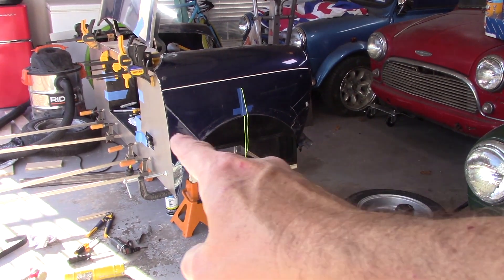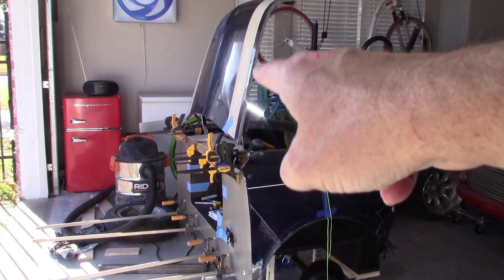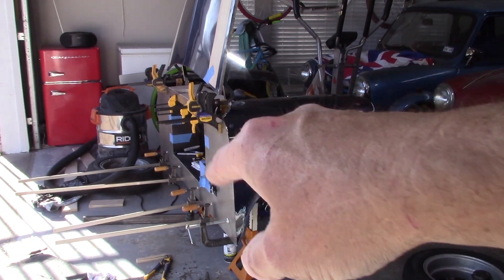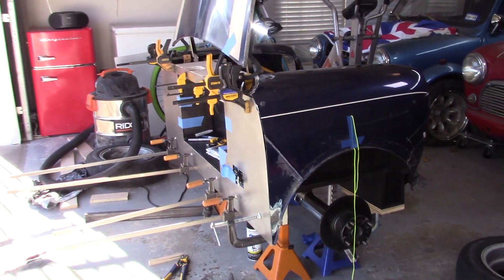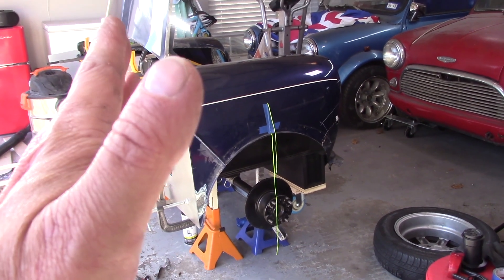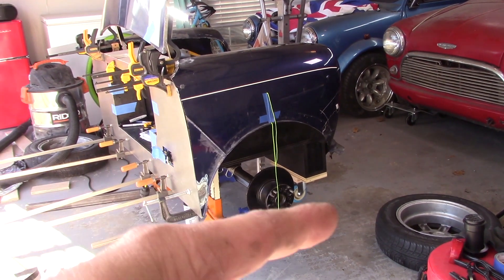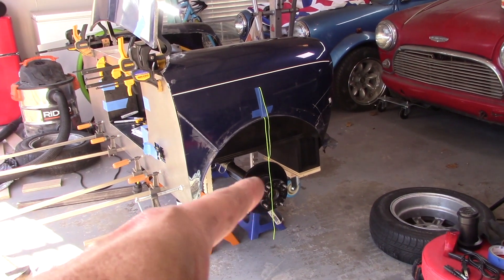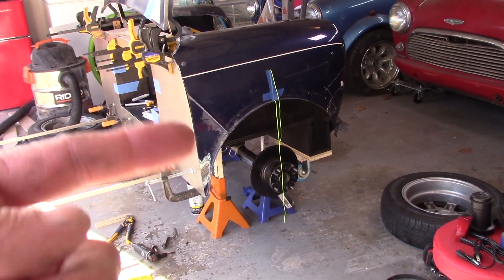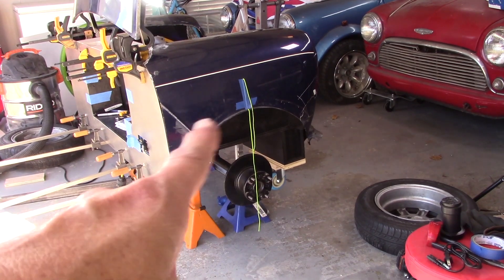The wheels are done. I'm going to put wheels on the back because adding that sheet metal makes it heavy, and when the bonnet is vertically up, it's back-heavy with the sheet metal and the bonnet. So I'm going to put the other two caster wheels back there. I also had to rework one of the axles — when I welded it the first time, the axle was not perpendicular with the disc, and that kept bothering me mentally. So I cut it off, modified it, and made it much better. Now both axles spin true.